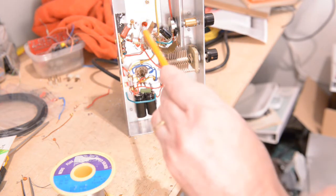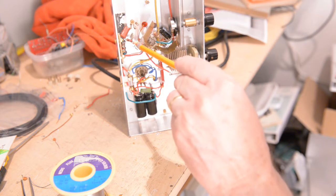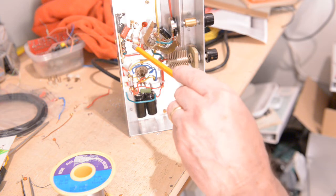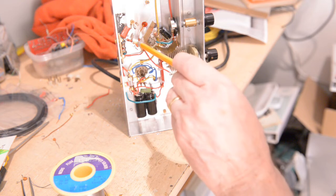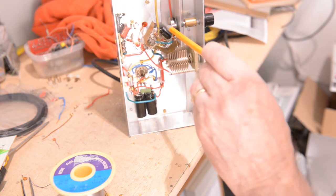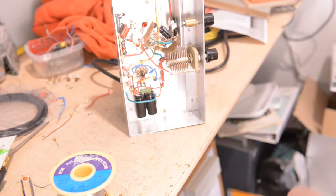So I put another resistor. I told that to you in the previous video. I used two other resistors, one 220k and one 10k. The 10k I used to get away from the anode from the triode, actually the receiver, the detector. So I put another capacitor in there, 220 picofarads, to ground that, so that no RF can go into our AF amplifier. So you just go here, capacitor, straight onto the pot, okay? So that's what I've done.